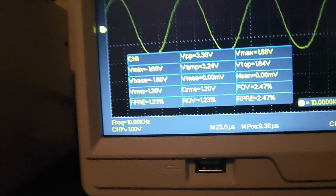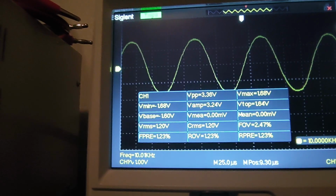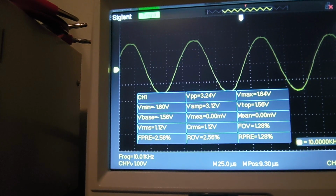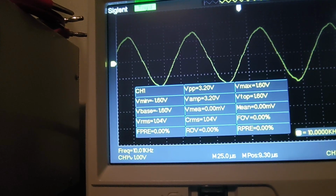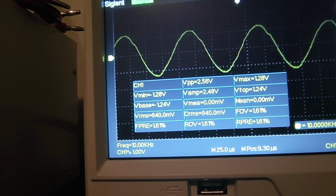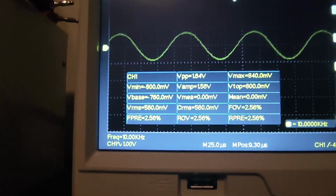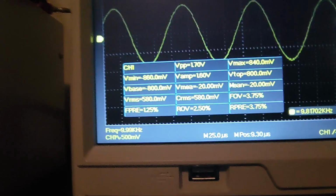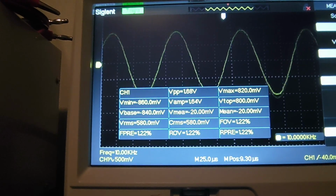And we're going to run through this again. Counterclockwise down to negative 15. Keep an eye on that waveform. Yeah, even up here you can see when I go negative, that signal starts to get a little distorted. I wonder if it will be as bad all the way at the bottom. Clears up a little bit on that pot. Could also just be the potentiometer.